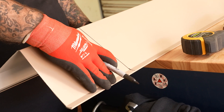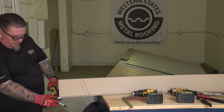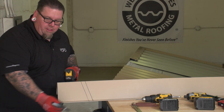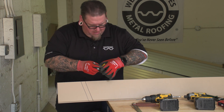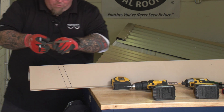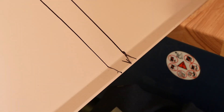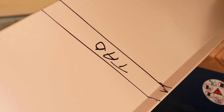We know that this is a half-inch kick, which if you were to measure from the side, it's actually three-eighths of an inch back. So I will make my mark at three-eighths of an inch to recreate the same distance as the front. Mark three-eighths of an inch, and then use a bevel or straight edge to recreate that same mark — and that's where I'll make my cut. This will be my tab, and I will cut the remainder off the top.